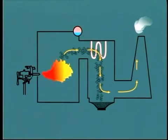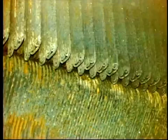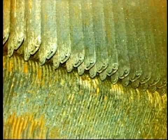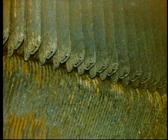However, not all of the ash is collected at the bottom of the furnace. Some of the lighter particles are carried in the gas stream through the superheater. If the ash particles are still in a friable condition, they may stick and deposit on superheater tubes and water wall tubes. However, in most cases, the ash deposits are more likely to be in the form of dust, known as fly ash. Where this does collect on superheater tubes, it will result in a reduction in heat transfer and consequently lower steam temperature.